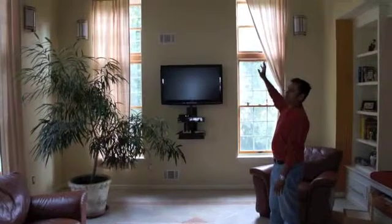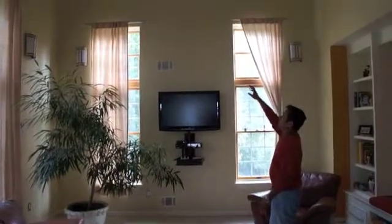The solar heater is really not visible from the inside of the house — all you see are the exit ports for the hot air coming in. The heated air in this particular case was being drawn from the basement, which is an open basement. It pulled in, heated up on the outside through the solar collectors, and blown back in up there. In effect, you're creating a convective flow of air inside the house and gradually raising the temperature of the house using solar.